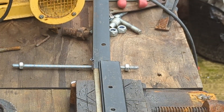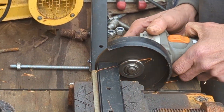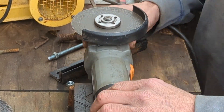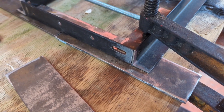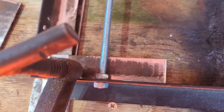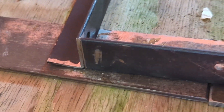Just got to square those up. Just getting it all set up to weld the first corner of the frame. I've got the bolt in there and in there perfectly squared up. It's nice and flat, a bit more paint to come off there, and then before I weld that one this will be leveled up again. So I'm just going to weld this corner, level check, and then weld this one and then do the back end.